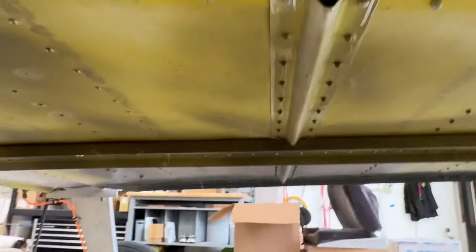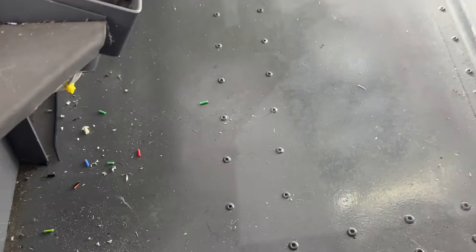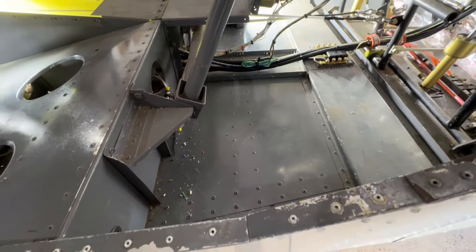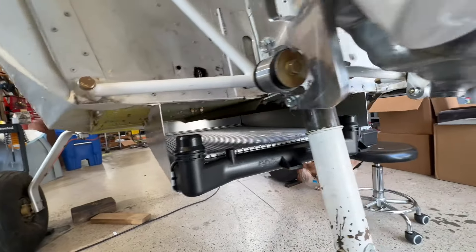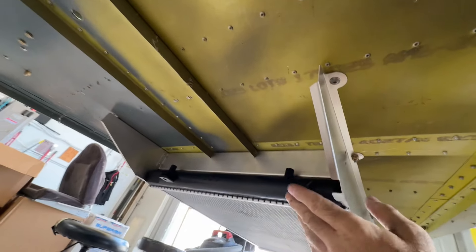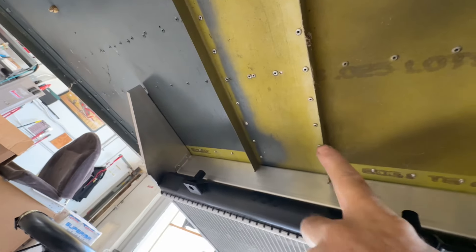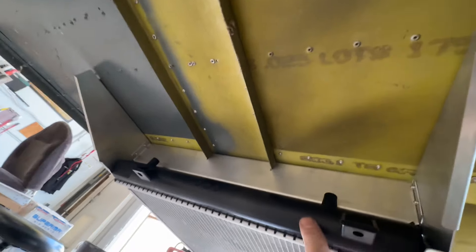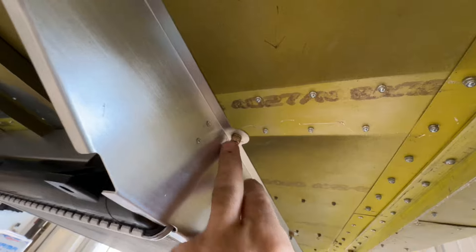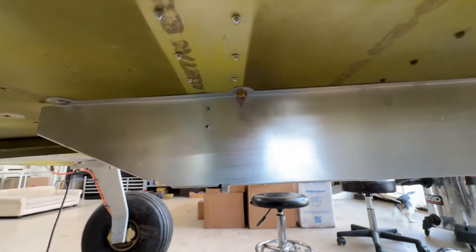Next, we're going to install our radiator on the belly. This is in the way, so we're going to put them on the inside — take those rivets out, take the left one, put it over on the other side, and vice versa, then rivet them back in so they're out of the way on the belly. We got the radiator up and mounted — it turned out nice. Look how sealed it is in the back there. We're using a new piece here — not necessarily closing off the back, since a little bit of turbulence there is good for more cooling. This piece up in here is a new piece made for a wider radiator, but I just trimmed it a little bit on each side and re-bent it so it fit. It has the notches for that and I glued it to the radiator with Right Stuff — but not to the airplane. I had to shave off a couple of rivets and will re-rivet them from the inside. Other than that, it fit real nice. The front is going to be lined up with the second rivet on each side.